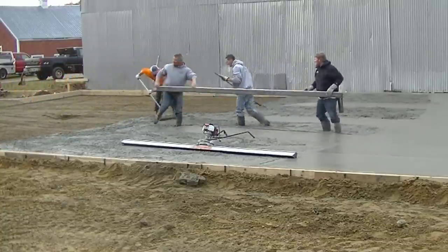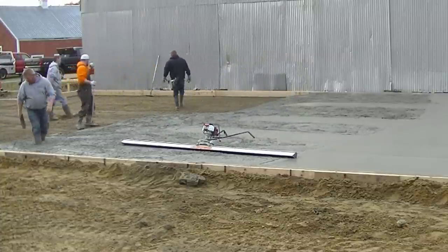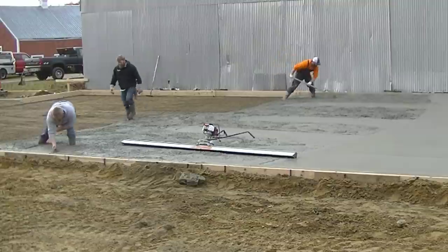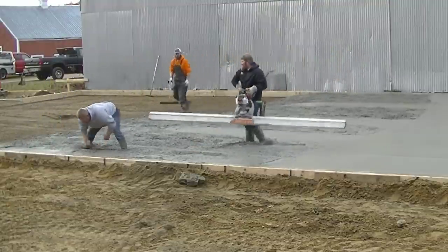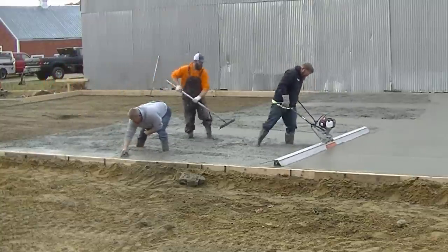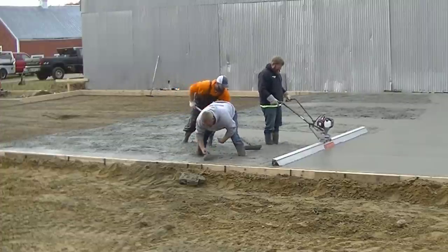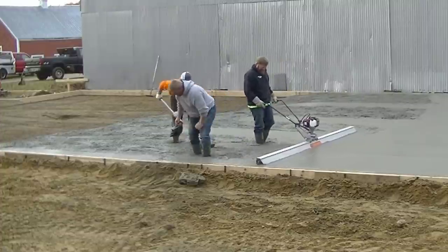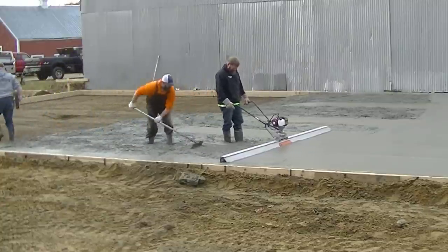The wire mesh for reinforcement and the double roll rebar around the edge is just for added insurance. We're going to power trowel this nice and smooth and saw our contraction joints in it, so this slab is never going to go anywhere. Eventually this guy is going to take that barn wall down and pour the rest of the slab in the barn, which is 80 by 60.